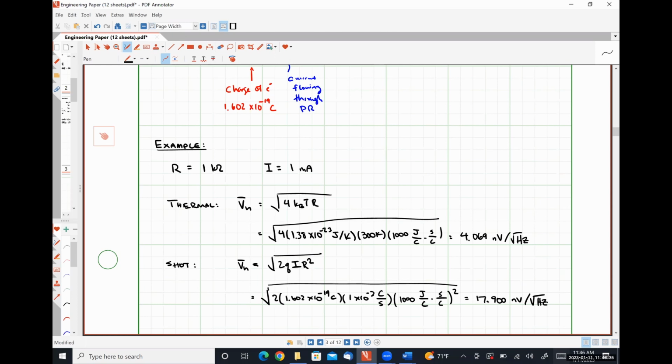Okay, so this is something that can significantly contribute. The best way to eliminate shot noise is to not use metal to deposit wires. Instead, make your wires out of very heavily doped semiconductor regions as well. I think we talked about the advantages of this previously. The semiconductor material obviously is going to have some piezo resistive effect, and we are implementing our piezo resistor as a semiconductor, and then we are implementing our wire as a semiconductor.